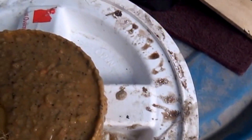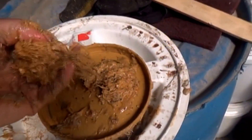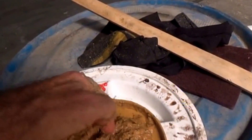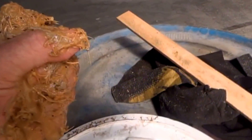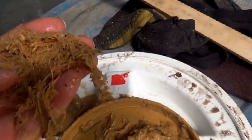We've got some of this food waste and press aid, and we're going to mix them up. We've got them mixed up, and this is really rough. I take this material and watch what comes through my hand — I should be able to get some water to come out. I've gotten water to come out, I've got a separation. A screw press could be very effective in doing this, and what I'm left with in my hand is a dirty press aid, but I've got the fiber particles tied in with the press aid.